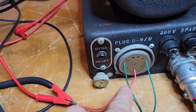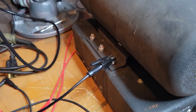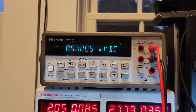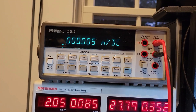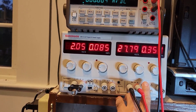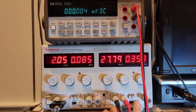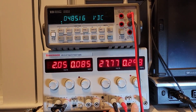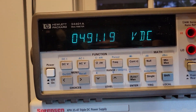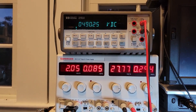We'll enable it. The red wire is in pin 1, going to my voltmeter. We're going to check the 400 volt output first, and then the 1150 volts, just to see if this is producing the power we expect. All we're going to do is turn on the bottom power supply, kick the motor on, and the top display will show the 400 volt power output. And there you have it — 490, almost 500 volts. That looks really good.